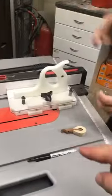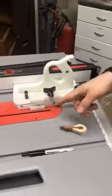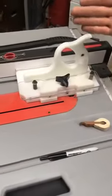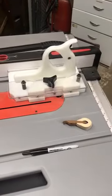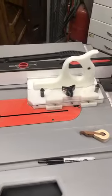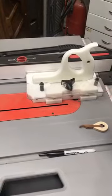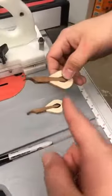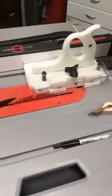So how come we have to do it for the grand hammers? We have to taper them on a saw, and we can't do it on the sander. So the table saw ends up giving it a better edge. Okay. It's more precise and replicated easier. The sander tends to do a pretty precise job, but it ends up... Yeah, it gets junk in the felt, doesn't it? So with the table saw, it just cuts it really clean. Do you do the uprights with this as well? Yeah. Cool. Same day.